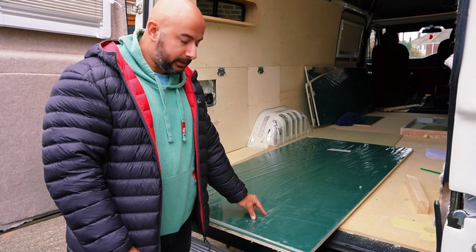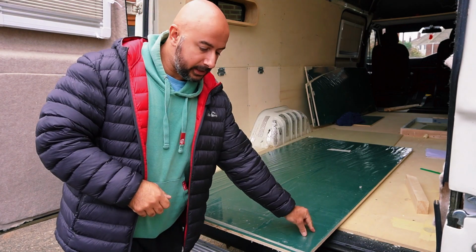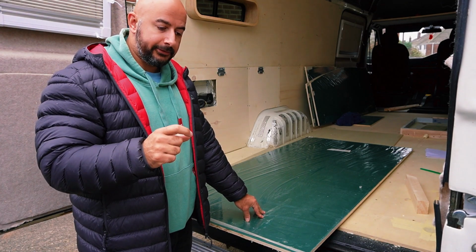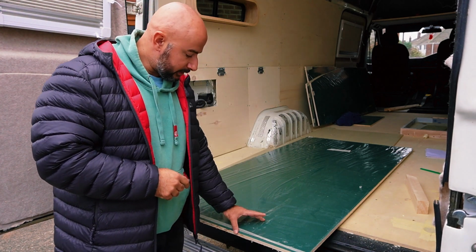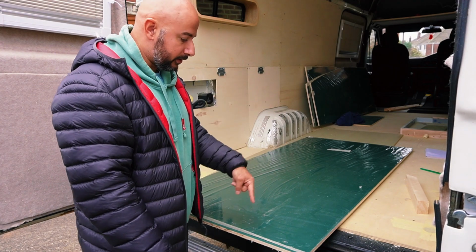I think it was 20mm for the door we're going to use. It's like this roll out door thing, so there's going to be a frame for that going along, so I need to leave about 20mm for that, and then I need to leave another 20mm for the rubber seal that we're going to put around this hole so that everything's protected. So there'll be a few inch gap here. I'll match the same on the top, and then I'll just come in a few inches on either side, and then that will be the door frame.